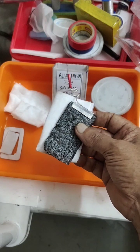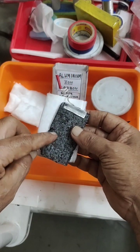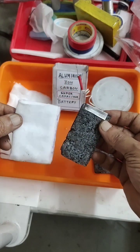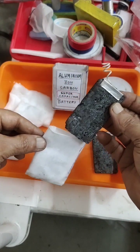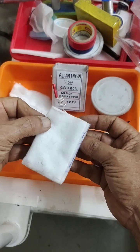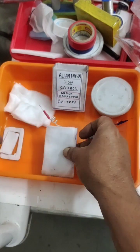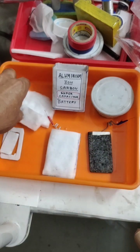I will fill the bag with carbon black, graphite, manganese dioxide, and traces of cobalt and lead. You can see my previous videos where I have used the same combination of metal oxides. After filling, I will insert the electrode, tie it, and make it the positive electrode. The plain carbon plate will be the negative electrode.